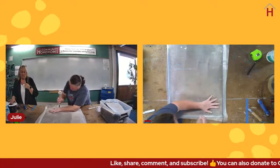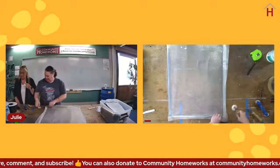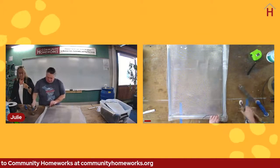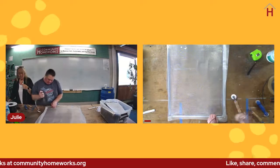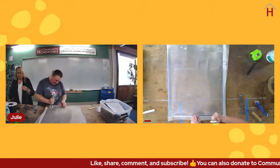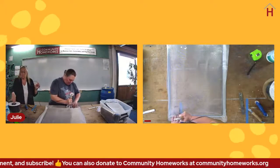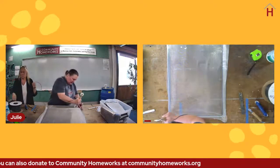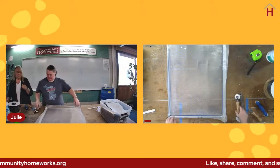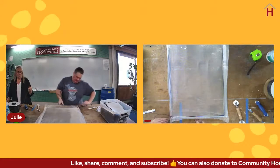So again, I'm holding the screen for these first two sides to try to get it to evenly pull from one side, in this case the outside. I'm going to tuck my screen in with this putty knife, and it's often easiest if you do that on both corners. And then go ahead and feed your spline in. Make sure that your screen stays in the spline channel. Again, if it pops out and you end up off track, you'll end up with a dent in your screen material.